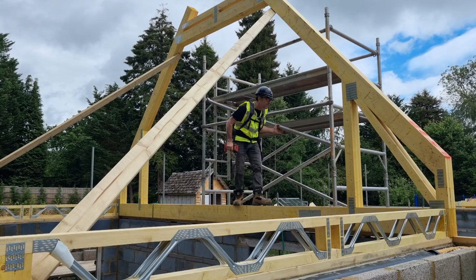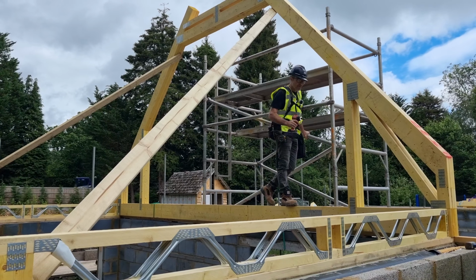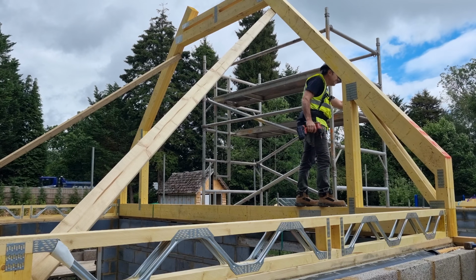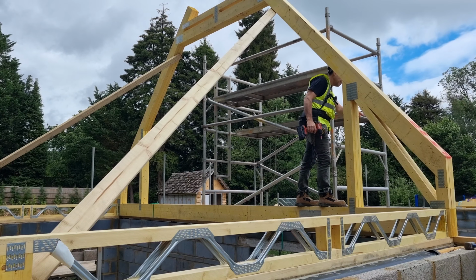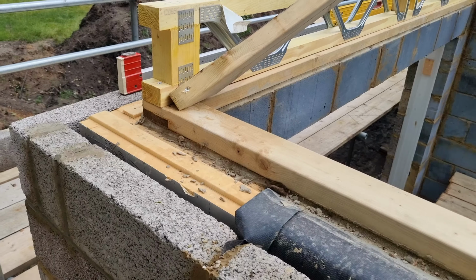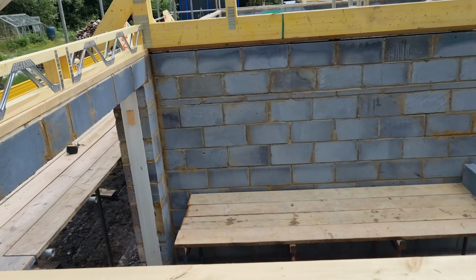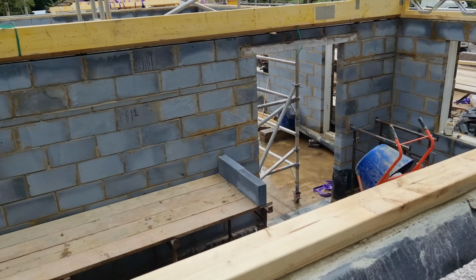Perfect, all right. We'll fine tune the top once we've got the bottom spaced. We'll keep the top once we've landed the next one. So we want the next joist from here, 2 of those. So we've taken our brace right back to the corner of the plate. It's no good sticking it on a bit of plate in the middle. That is just going to shift.